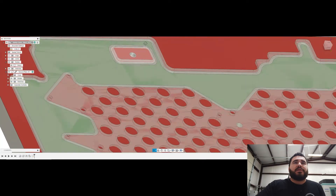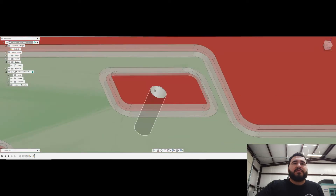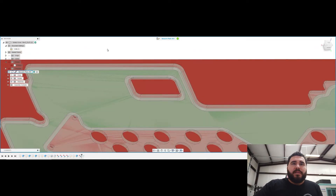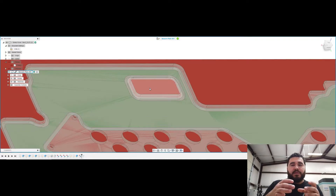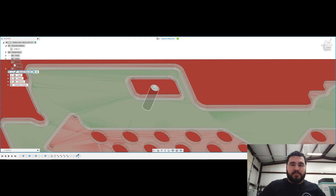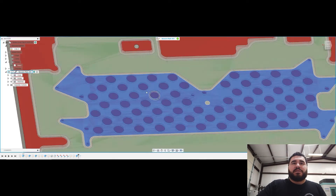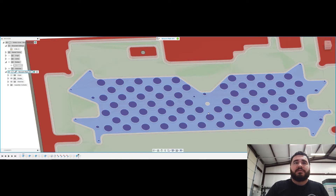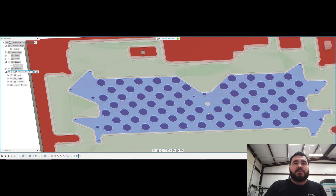Third tip: vent any areas that are sealed off. You can imagine this little area here would be completely sealed off if I didn't have a hole there. If I didn't have a vent hole through there, that little pocket would trap air. When you suck the sheet down to the plate, that trapped air pushes against the vacuum force and reduces your overall vacuum force. So you need to vent those holes so trapped air can escape. The inner area is actually a lot of air — if you don't give it somewhere to vent, it will push the part up, causing Z-height deviations and decreasing vacuum force.